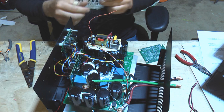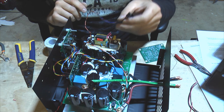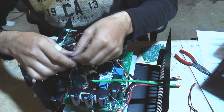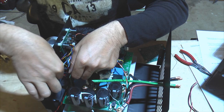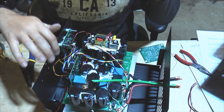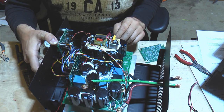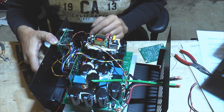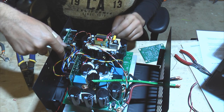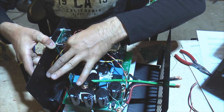Soldering is done. Connect the power wires to the driver board, route them, and plug in. It's getting a little crowded but twisted wires help make sense of all the connections. The only thing not yet connected is the thermistor — by now the silicone paste is probably solidified so we can connect it.